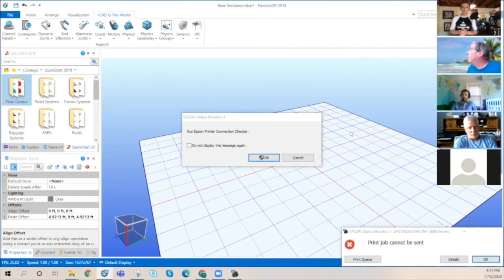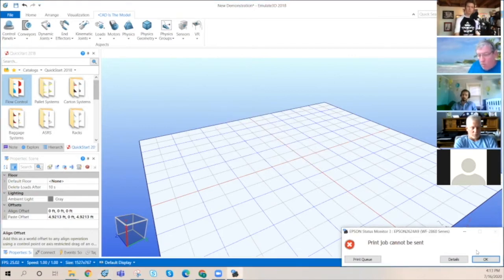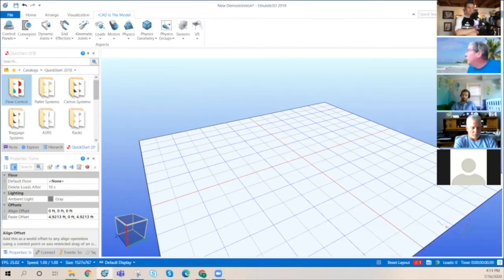Now, there are issues that would need to be considered. There's communication speed. If you're trying to run 5 millisecond updates and you've got 1,000 I/O points, we have a problem, because that blue cable running from the server rack or from the controller to the computer is not fat enough to do that. I'm being euphemistic here, but that's just the reality.